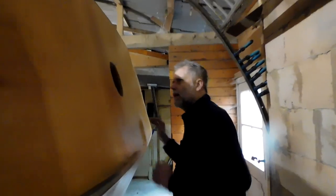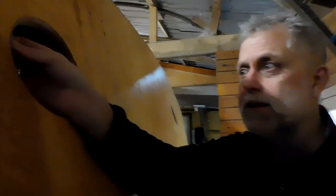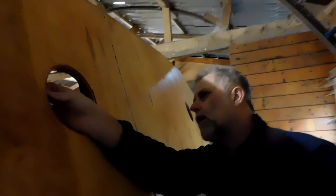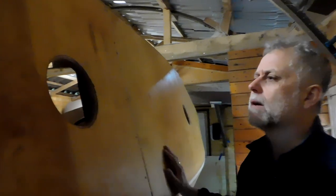I don't know if you can scan around in there, Kerry, as much as you can. Is it in focus? Let's hope. So the second one here. Pretty good, pretty good. You can see the glue here has swollen up a bit where the boards aren't quite tight together, but the rest of it, all the way, the boards are really tight. And here, remember that glue fills gaps, it is strong at gap filling up to 1mm. So it's come out okay.